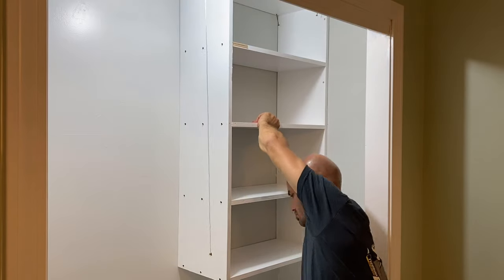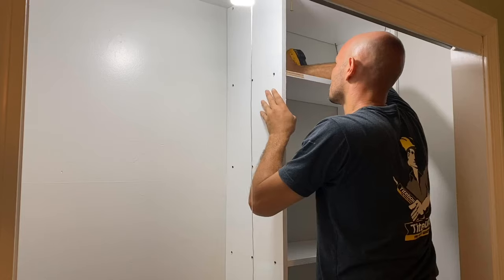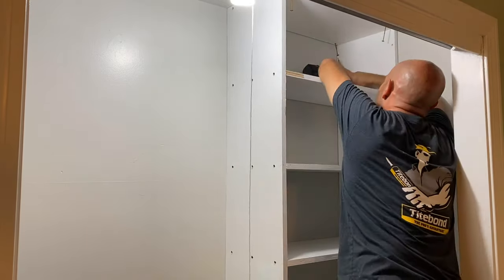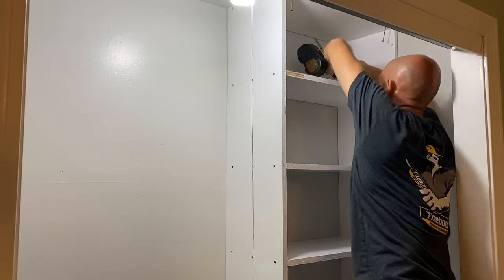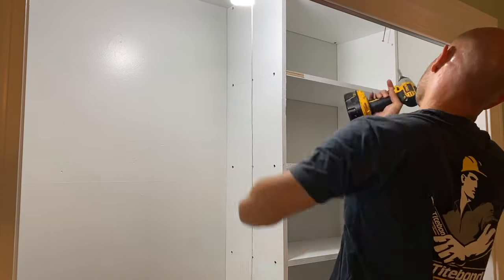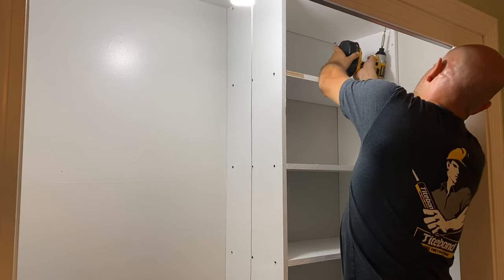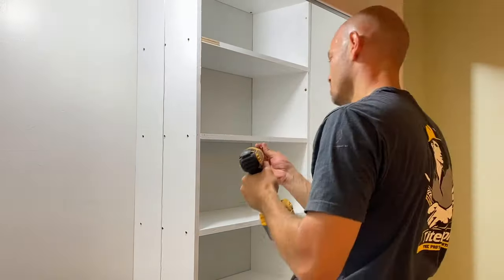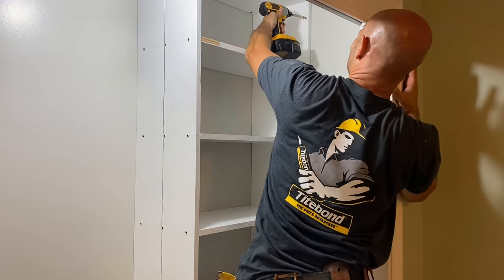So I set the box that I built up into the corner, used a couple of cleats for some bracing. I used my stud finder to find where the studs in the ceiling were — the joists actually. I have three and a half inch screws and those are catching the ceiling joists, using my impact driver — it's a nice tight fit. Then I also have studs on the side, I found those with the stud finder, and I'm screwing my three and a half inch screws into those as well.